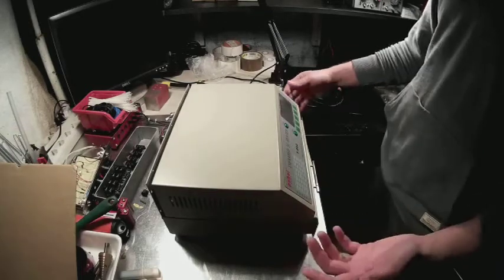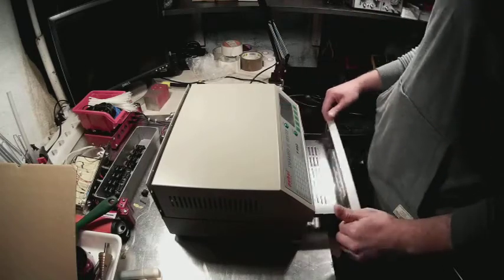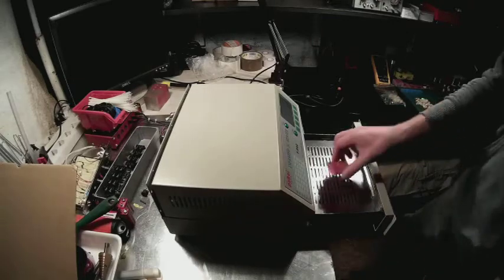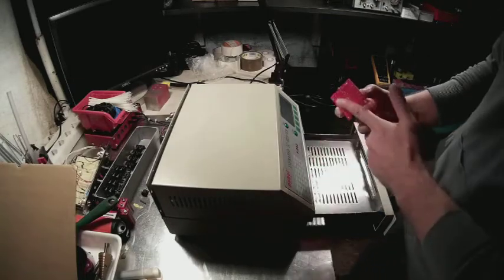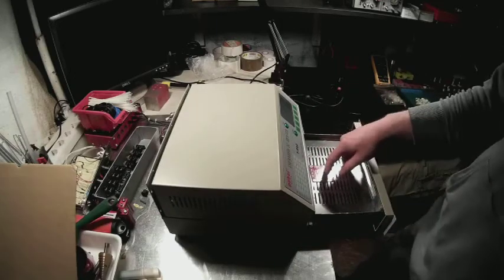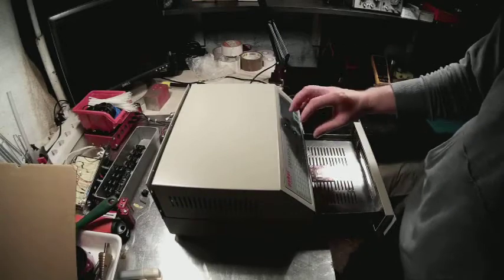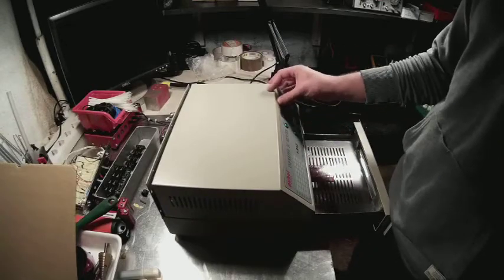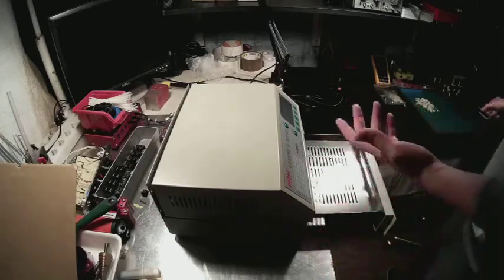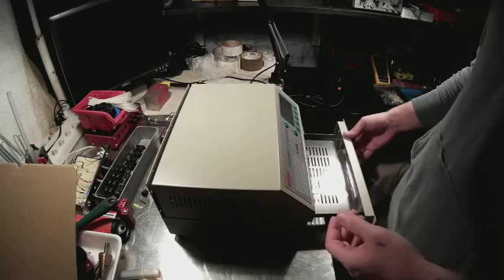What I'm going to do now — and I'm going to film it — is fit a small test board inside, put the thermocouple on the back, and actually measure the temperature in the oven to see if the profile is good. A lot of people complain that it overshoots a little.